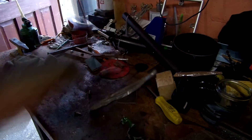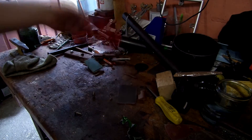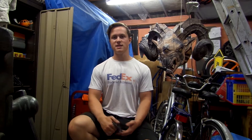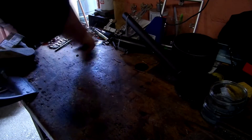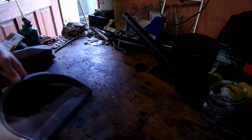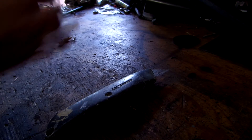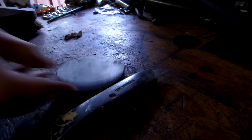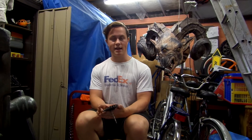I built this using fairly simple tools - just a drill press, some files, a hacksaw, just the kind of thing you probably have in your workshop already. I started out with a steel disc. In other applications it wouldn't need to be steel, but because it's a jet engine with extremely hot air, steel is really the only thing I could use. But you might need aluminium or even plastic. I got it off eBay - they have a depth of about 10mm and are about 94mm in diameter.